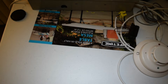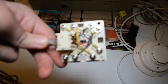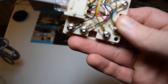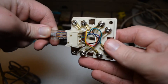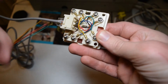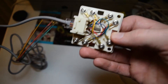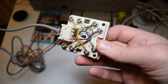In order to accomplish the line seizure method, we have to use one of these. Alarm technicians definitely know exactly what this is. This is an RJ-31X connector, and it also has an RJ-45 cord that plugs into it. On the end of that cord there are eight different leads, and on the biscuit — that's what the base is called — there are also eight different terminals.